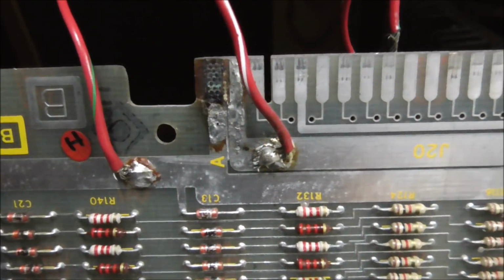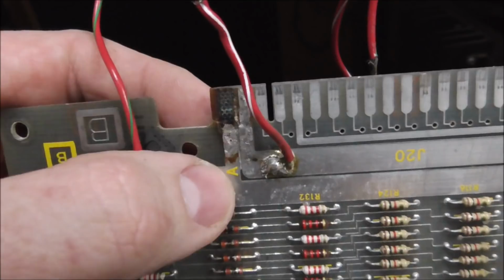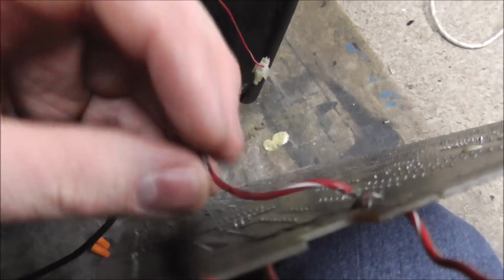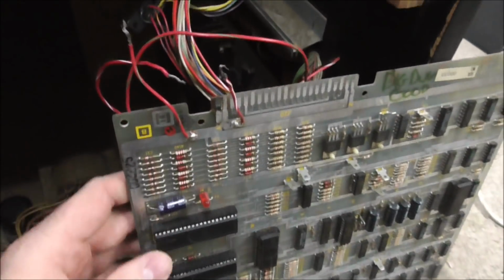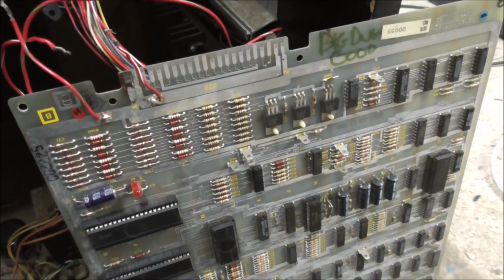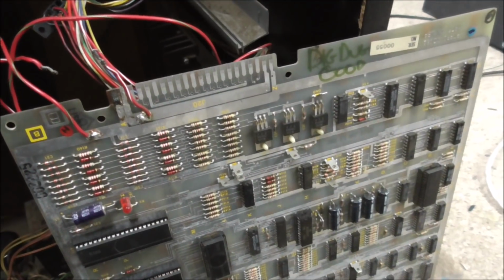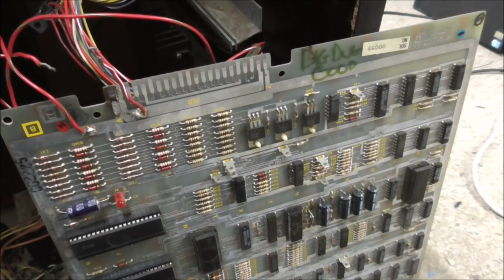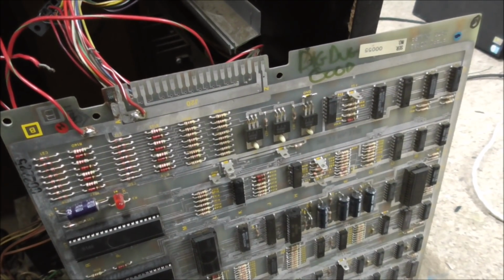Focus. Ah, the wonders of a button. Yes, we got an issue here. So they had soldered this here, and then a third one on the back, and the 4th one never got put on. But, hey, it was working. Can't say too much about it. It was working. Sound's not working, but... So I'm going to clean up that connector and put some new pins in, and then we'll look at the board a little bit.